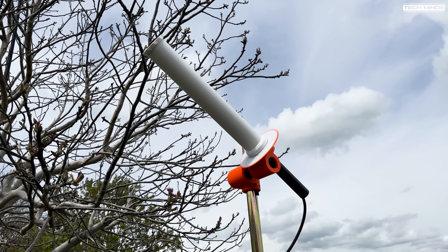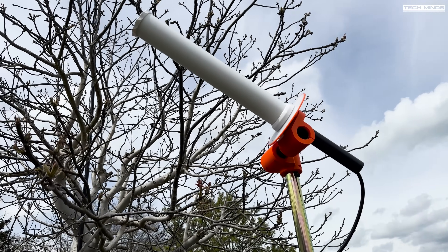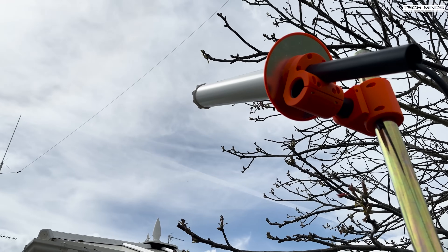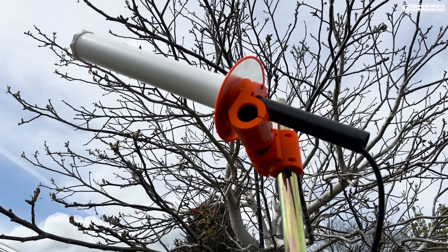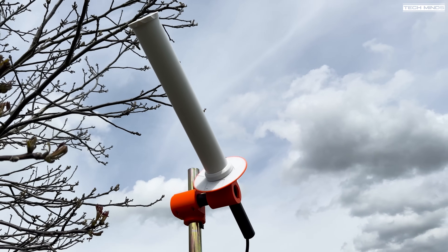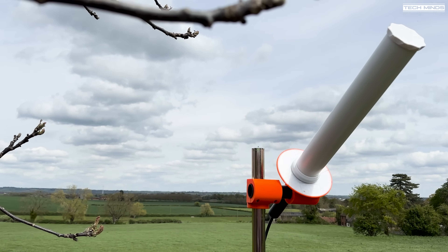Outside we can see how I installed this awesome looking L-band antenna. Each of the sections where the pole goes through are tightened using pre-installed bolts. You can tighten these bolts to the point where the antenna stays in place but is still movable both left and right and up and down. This will help you align the antenna and point it directly at the Inmarsat satellite you wish to receive. Once it's aligned and you have the strongest signal strength possible, you can just nip up those bolts on the brackets — but just be careful not to over-tighten them, as these parts are 3D-printed plastic.